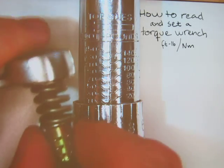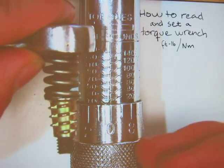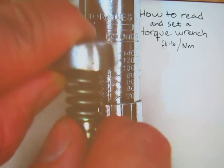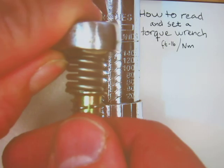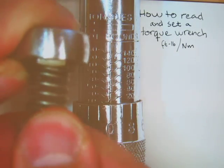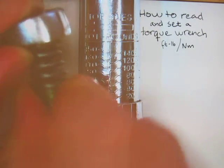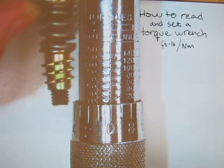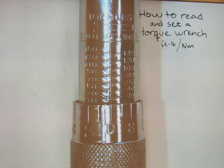Here I have a fastener with a nut at the end. As the handle on the torque wrench travels forward it also compresses a spring ahead of itself - something like this: as I spin this nut forward, you can see it's compressing the spring coils to a tighter and tighter formation. As I loosen it, you can see the distance between the coils increases. So the strength of the spring inside the shaft of the torque wrench is translated to a torque setting.